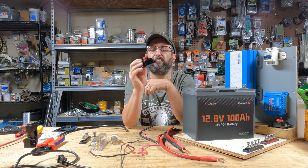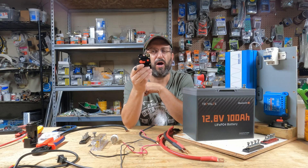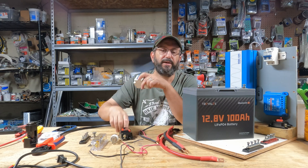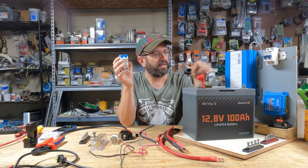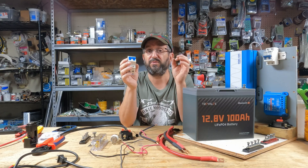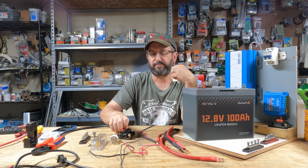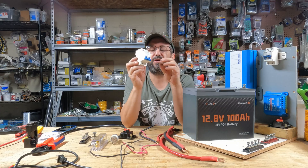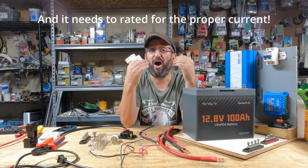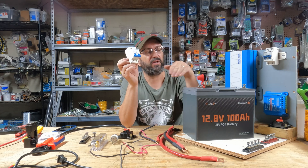This is a standard DC circuit breaker — a marine/auto circuit breaker that can do up to 48 volts. In a 12-volt system you'd think it's fine, but the solar panels are high voltage. That Victron 7515 charge controller can take 75 volts of solar input, and 75 is greater than 48 volts. So you need to use a high-voltage circuit breaker. Some systems can do 100 or hundreds of volts, so you always need to use a high-voltage circuit breaker between your solar panels and your charge controller.